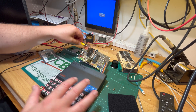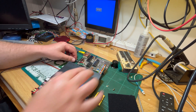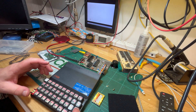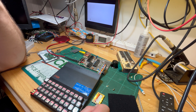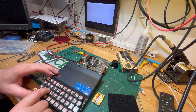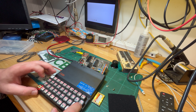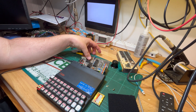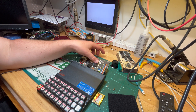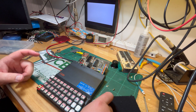The output is a bit dodgy since it's not in a case. A number takes 5 bytes, so if we dimension an array - let's say 2k, so one of 200 or say 250 - if we do DIM A(250), that's over 1k, so 2k should be working as well. The ULA's getting hot, the Z80's getting hot, and the ROM's getting hot - it really needs to go back into a case.